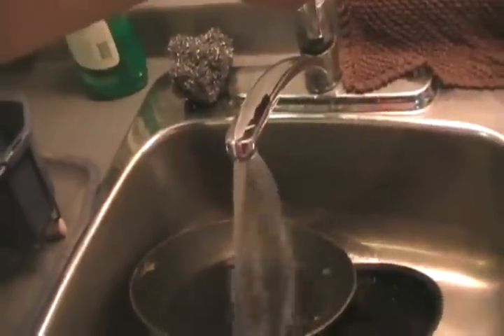Water pressure of course works, but it's got more neat innovation than that. It's got a pressurized backup tank in the basement that's about seven gallons, so while this thing is filling and unpressurized and open to the environment, the water system still works for several toilet flushes, washing your hands, or doing a load of dishes — even while it's filling.